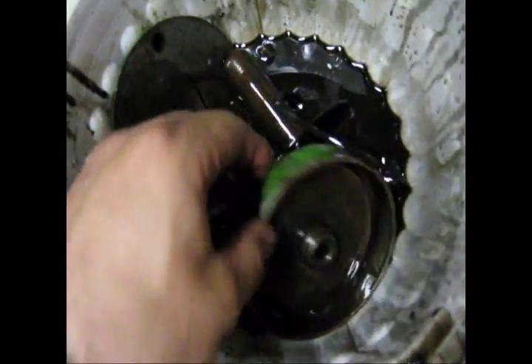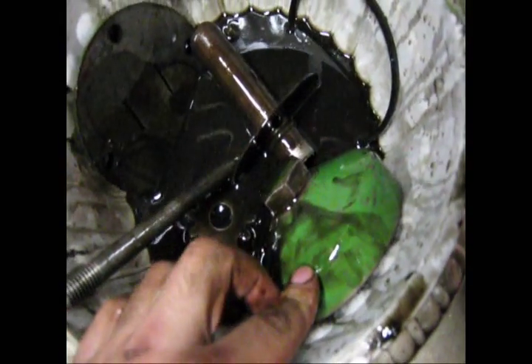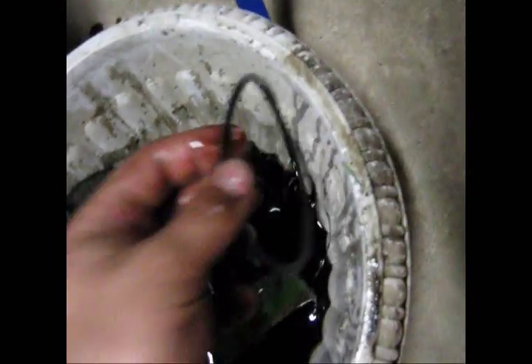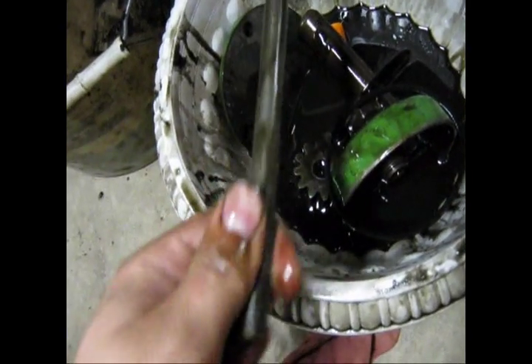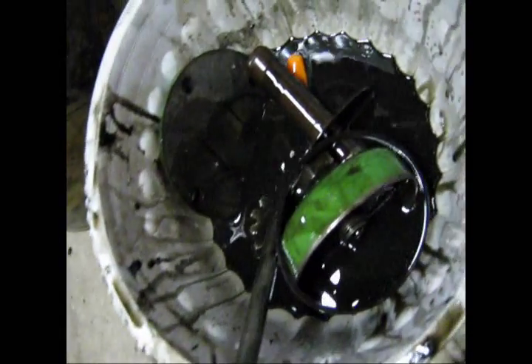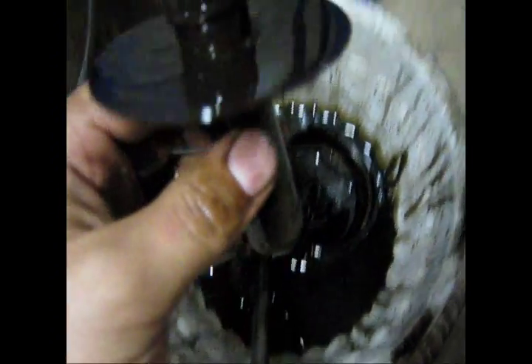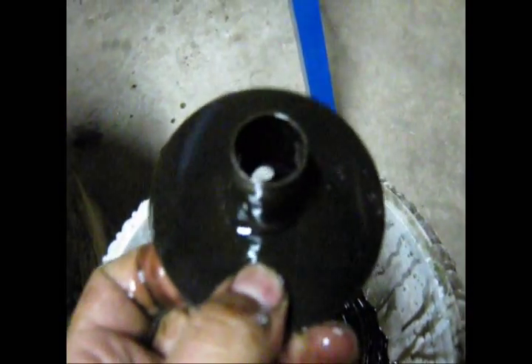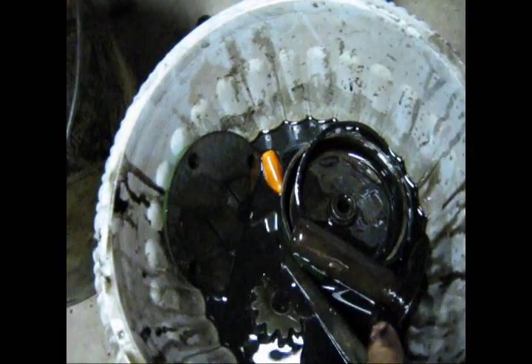Let's do a run down one more time. You're doing your oil filter on the John Deere Model A. Pull this off — a one and a quarter inch wrench will pull this off. Then you have your gasket that goes around that, your oil filter, and the stud in between the oil filter that does not come out — it needs to be straightened though. Looking up from underneath the tractor, oil filter touches the top and seals it. Tighten it too much and it's blocking off these passageways that are on the sides of this thing.